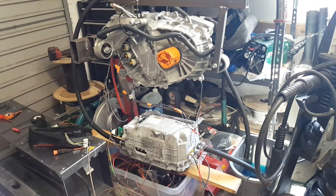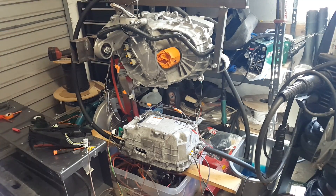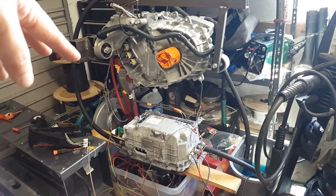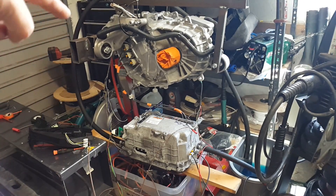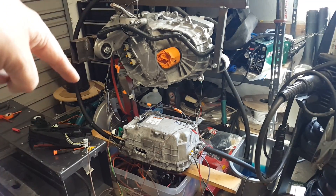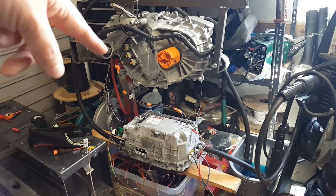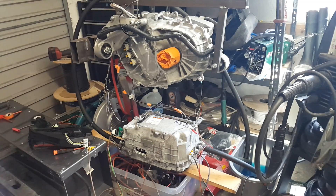Pretty much today, as soon as I put it on, it did the exact same again — it didn't rotate even with very high ID. So I started off methodically and swapped the polarity on the resolver: sine, cosine, exciter. It turned out the very first thing I did was swap the polarity on the sine, put some manual ID in, and the motor started spinning. So I knew I had it.